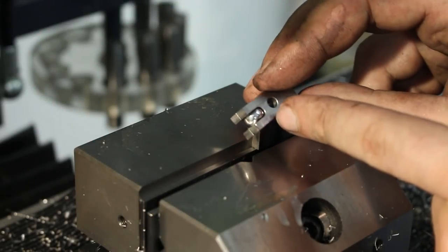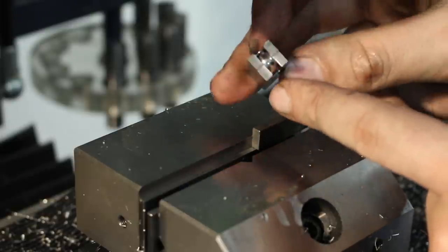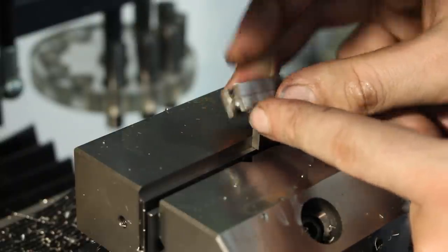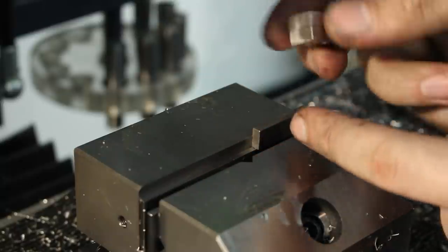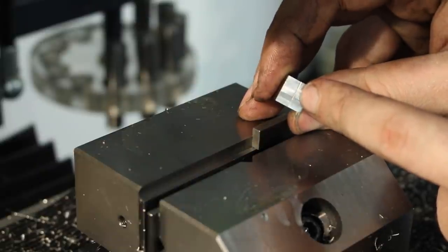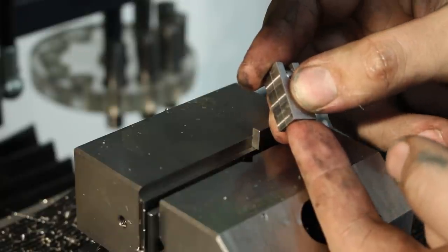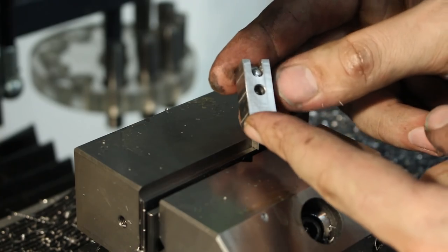Okay, I have the ball-shaped counterbore in each of the clamshell parts, and I put them together with a spare 10 millimeter bearing ball in between, so the parts are aligned against each other, and this makes it very easy to drill and ream the 6 millimeter hole in the back of these parts. This is the connection to the 12 millimeter rod of the indicator stand later.